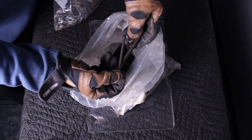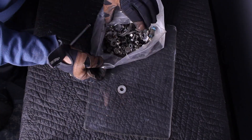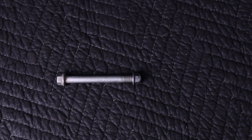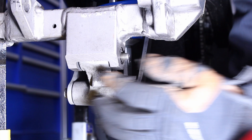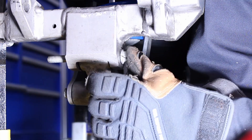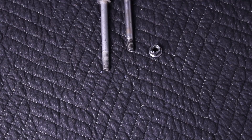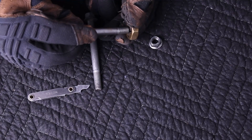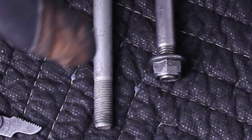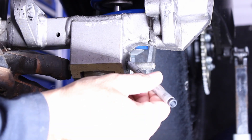My many years of weight savings has left me with a lot of bolts. I don't think anyone will know this is a Suzuki bolt. The bolt fits and it has the length needed — just have to make sure it's an M10 with a 1.25 thread count. I believe this to be a leftover bolt from my wife's R6. We need to mark the length of the thread needed.